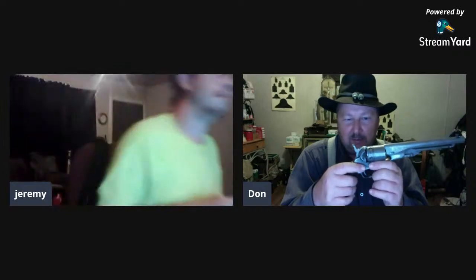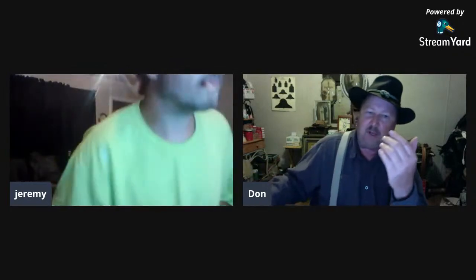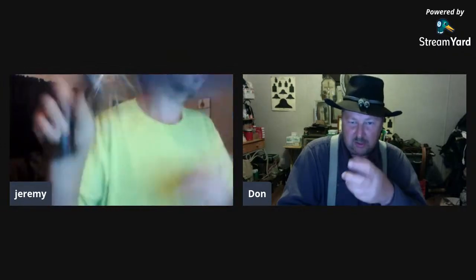And I don't like taking it off the hand. Okay, the hand, when it comes up over here to rotate the cylinder, I don't like taking it off the hand. But I don't want to take too much off the locking bolt either, because I want to make sure it's got a good chunk of meat to hold that cylinder so it doesn't spin.